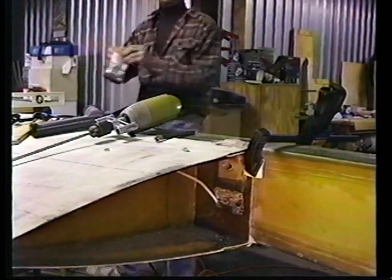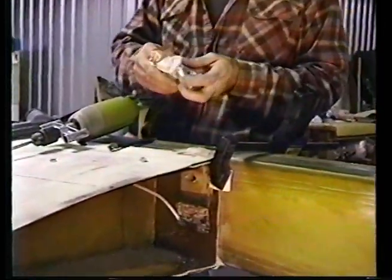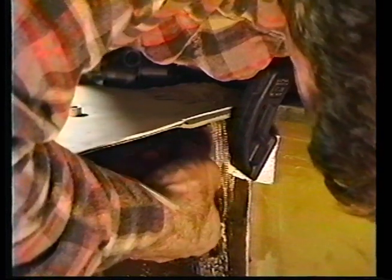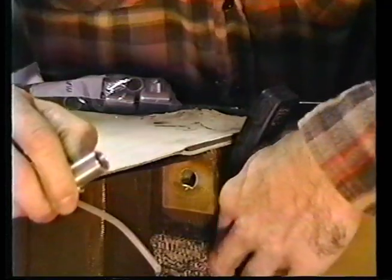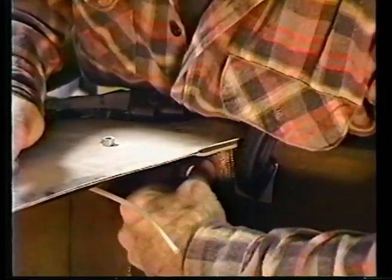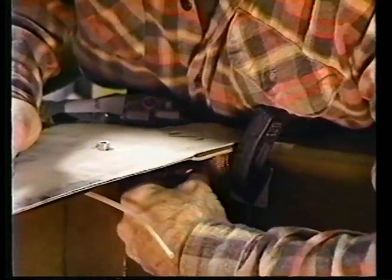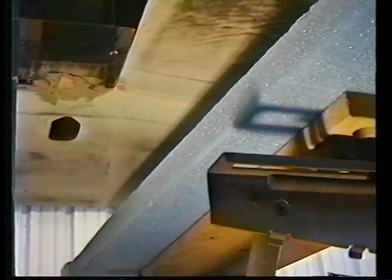There we go. These are the bushings that you're going to cut to length. And it should slide right into the hole. Except it doesn't go in from this direction, it goes in from the other direction and gets cut short, just short of this opening. The diameter of the broach was perfect. Very close tolerance. I can't make it wiggle around inside the hole or anything. It fits very well. I want to show you how everything looks here on the bottom side, so you get some idea of what it...